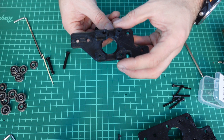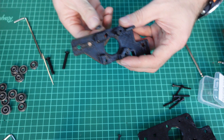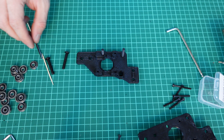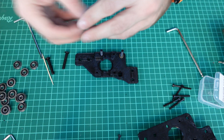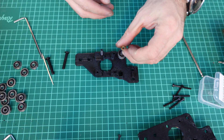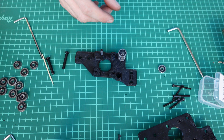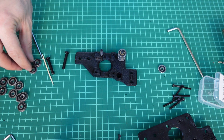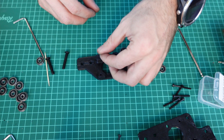You'll have to put two M5 screws on the bottom of the frame like this and then start assembling. First comes one spacer, then a bearing stack, then two spacers, then another bearing stack, then yet another spacer. This curve should have one spacer, one bearing stack, and one spacer.